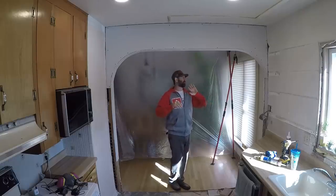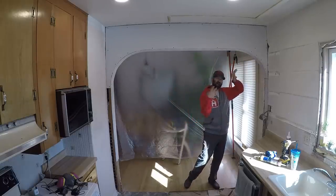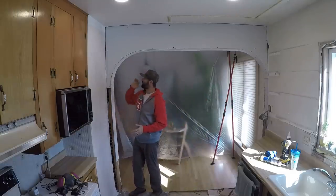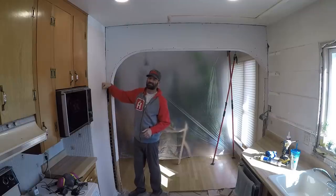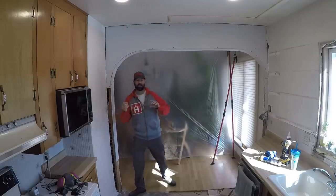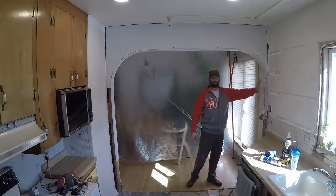The most asked question was about how I am tying this into the wall, how it's diving in on one side. This side, I couldn't have it die into the wall because this is a brick chimney, and there's no way to get any framing in there like I was able to do on the other side by putting the framing into the exterior wall.